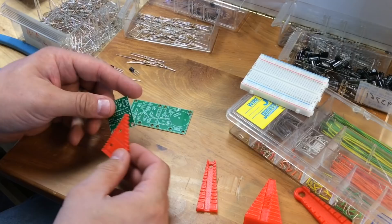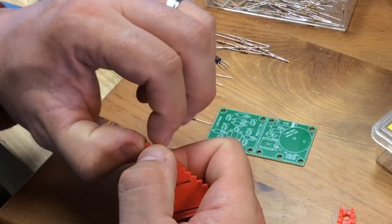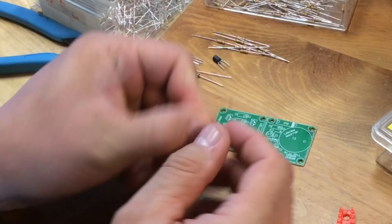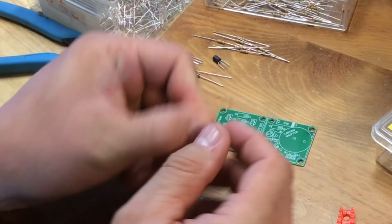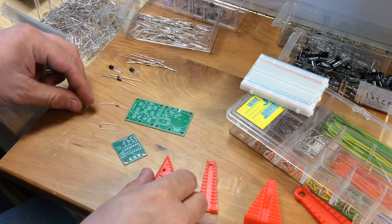The triangular design looked very promising. When I held it next to the eighth watt, it fit on about the second position. So I stuck an eighth watt resistor in that slot, but it didn't exactly fit in the opening. I had to hold it with my thumb and then bend it, which made it a little harder, and you can see the leads are slightly off. But it seemed to fit the board pretty good when I pushed it in and everything straightened itself out. So this one worked — I give it credit, it can do eighth watt resistors.